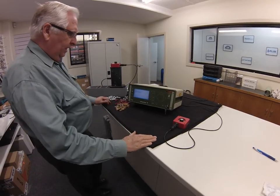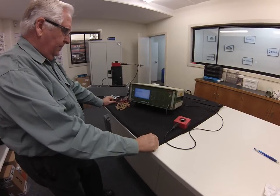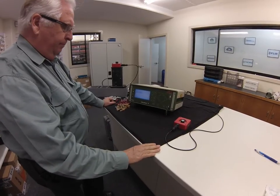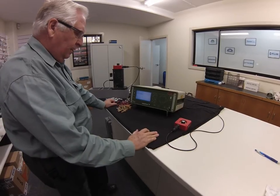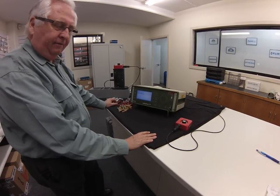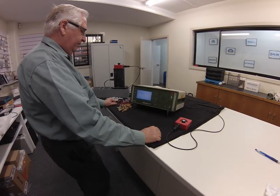Today we're looking at the Eddyliner P from IBG in Germany. This is a bolt sorting application, and it's using the IBG preventative multi-frequency testing technique, where we don't just look at one frequency of eddy current, but we look at multiple. In this case we'll be looking at 8 different frequencies. By doing this we can guarantee that we get a positive sort every time.